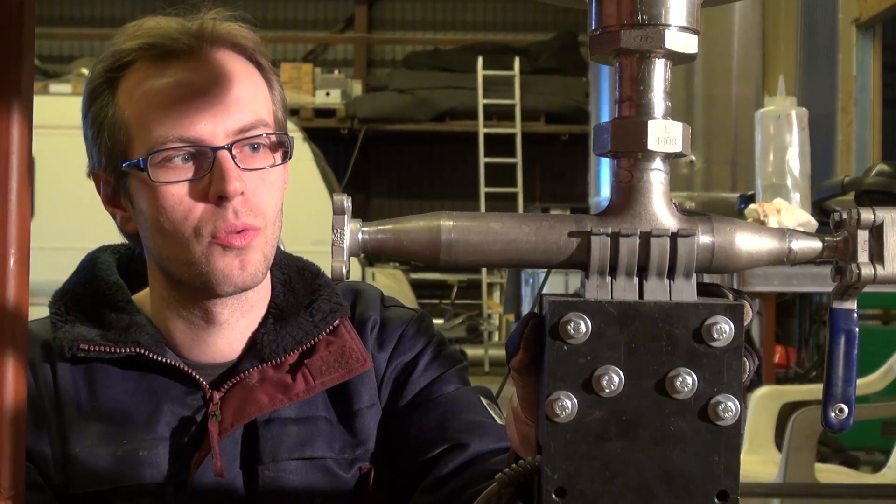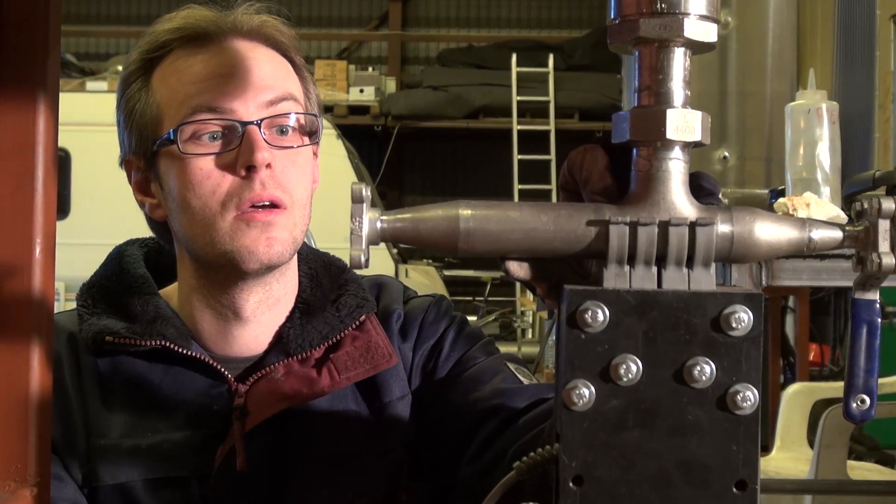This is one of the stainless steel propellant tanks and it's standing on top of its load cell. We will weigh the tanks and thereby measure both the amount of propellant that's in it when we fill it and also the consumption as the engine is firing.